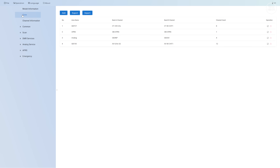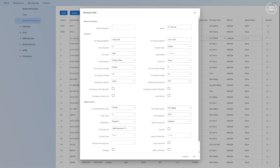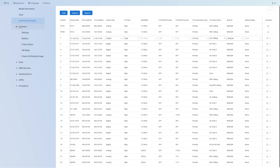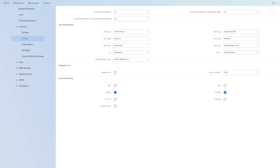The H1 comes with a programming cable and you can download the software for free from the Retevis website. A lot of newcomers to DMR find it quite overwhelming — it is one of the most complicated digital modes to program compared to others, since DMR was initially designed for commercial systems, whereas D-STAR or Yaesu C4FM are designed for the ham radio market. After programming many DMR radios, this software is laid out quite well, and feedback to Retevis is actually taken on board.